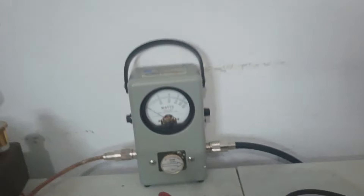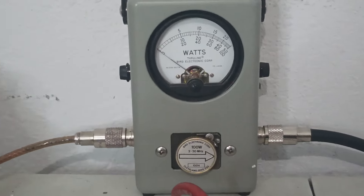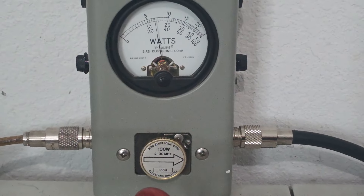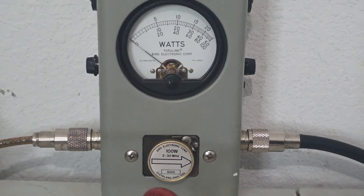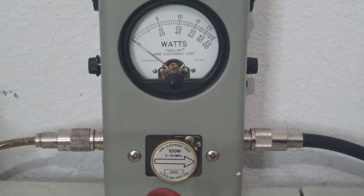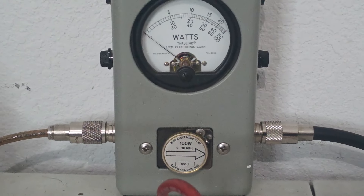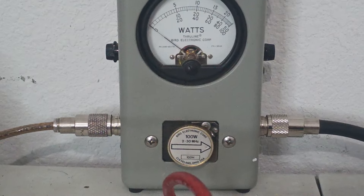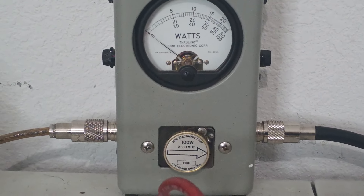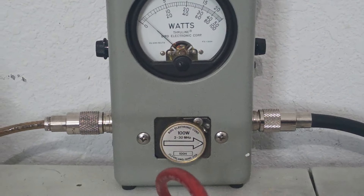Let's key this guy up. Remember, we haven't had the average power mod done, so average power is not going to be crazy high, but we should see it pull forward just a little bit anyway. 100 watt slug, bottom scale. So 20 watts average all the way up to 30. If we turn it down to let's say halfway, we'll get a 10 watt dead key swinging into 20 average — that's still not too bad. When you have all these done all the way, they'll go from like 10 to 40 or 50 sometimes. Nine o'clock position: keying six, five, swinging past 10.